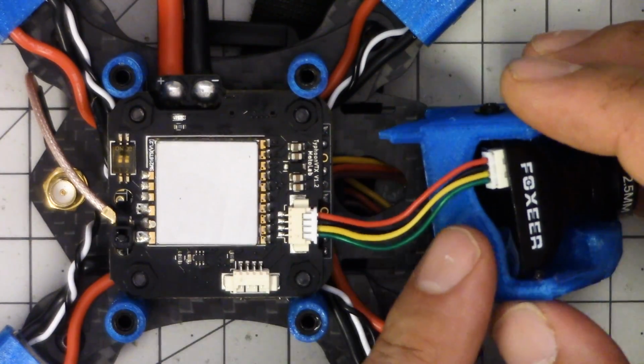And this is going to be really exciting in the future because Betaflight has a feature that exists right now. It's not widely known and not widely documented, and yes, I'll make a video about it eventually. It has camera OSD control. Now, this was a feature that, as far as I know, was first invented by TBS, credit where credit's due, for their FPV Vision and PowerCube stack. And what it lets you do is access the camera OSD menu from your goggles and your transmitter sticks, just like you're accessing the Betaflight OSD. It passes through the commands that the little joystick makes.